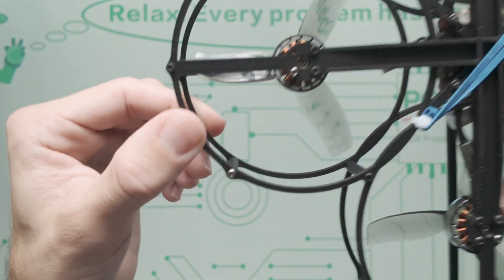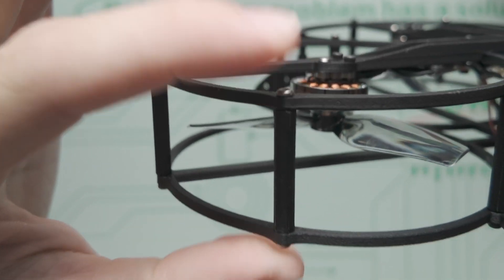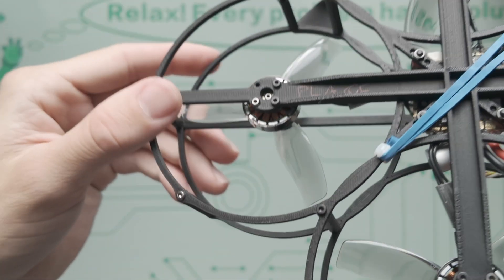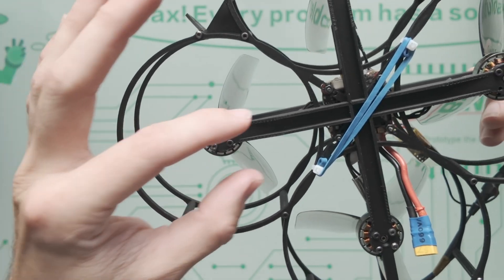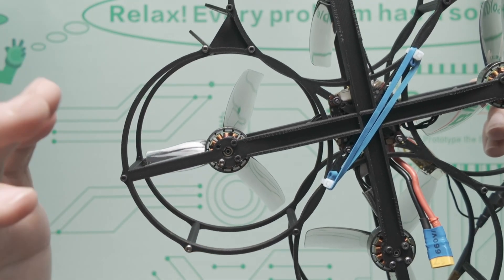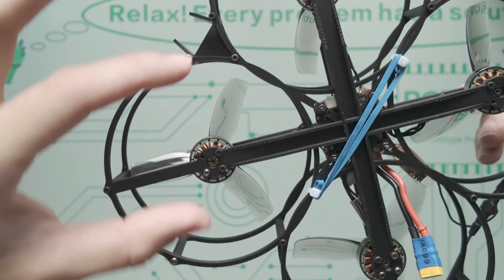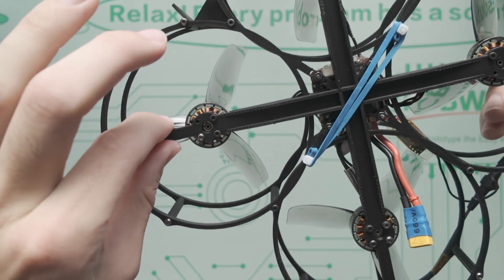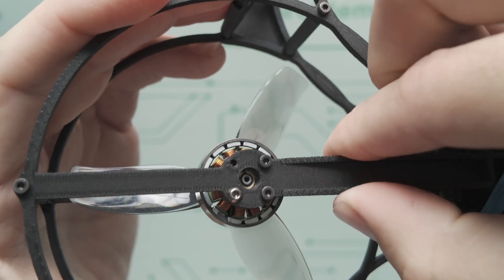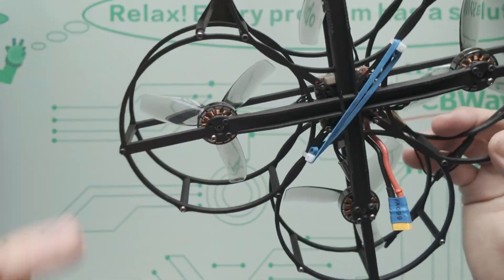These parts are actually quite strong for how thin the material is once they're stacked and screwed down. The standoffs are also 3D printed in the same carbon fiber PLA. I'm thinking U-channel all the way down, and then at 90-degree angles to it, add some supports — maybe small U-channels — to support the motor and keep it from twisting back and forth, which is probably the biggest issue.